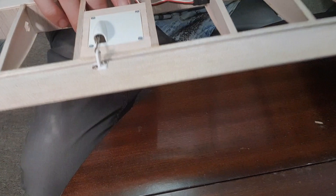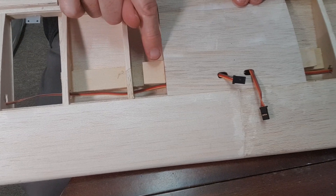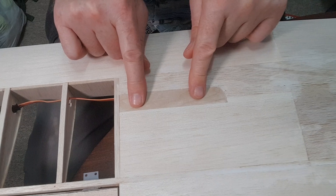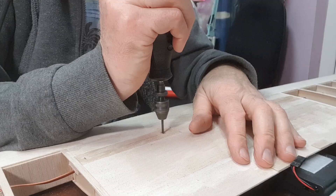The next job is to concentrate on the undercarriage. The blocks are on the inside — the leg goes up into there, runs along, and drops down. So I need to make the undercarriage legs and drill a hole in the correct position for it to slot in, then put a couple of saddle clamps on the plywood. Here are two undercarriage legs — didn't take much bending. I just need to drill the holes in the wing and get the saddle clamps on.